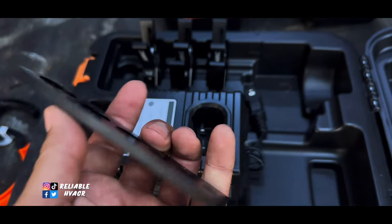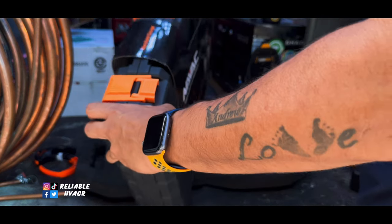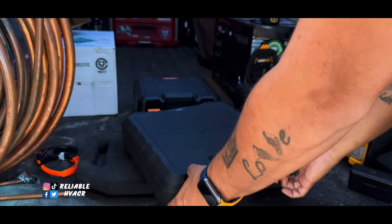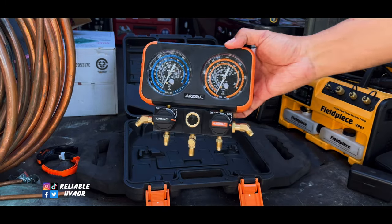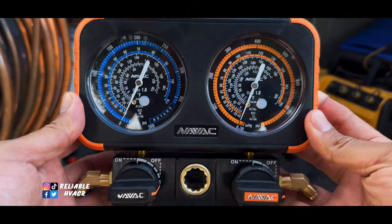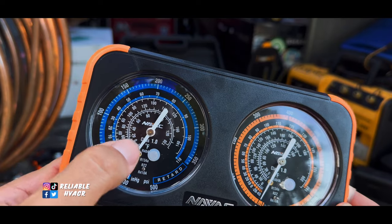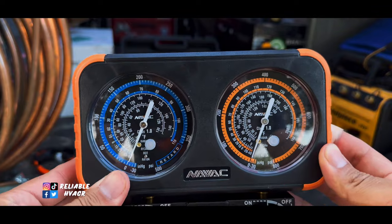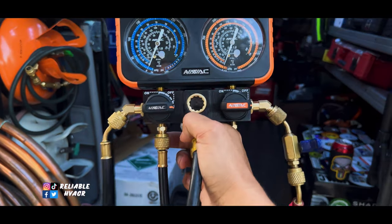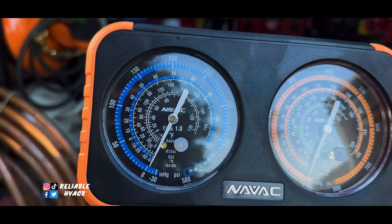You should be able to see if you have a perfect flare, and you should get a perfect flare every time. Now let me open up the gauges. There we have the NAVAC impact-resistant gauges — they cram all that in there. They're not color-coded but it gives it a nice aesthetic. I put my hoses on there — that layout's going to take some getting used to because they put them on the sides, but you've got 410A, R-22, 134A, and 404 at the very middle.